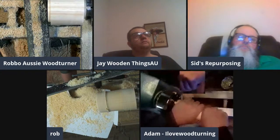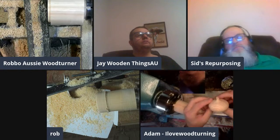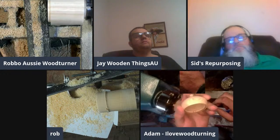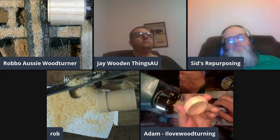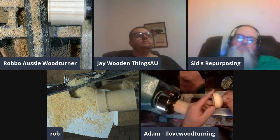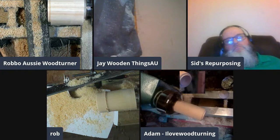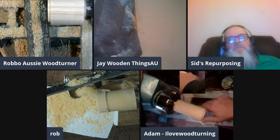When you've got that done, you can take the lids off the base if you like. Don't remove the bit of wood out of the chuck. Just take the lids off the chuck, off the bit of wood. Rightio. Now we get to the fun bit. Pulling out the inside. Just wait a second. Now, what we're going to do is make them like an egg inside. As if you can imagine the profile of an egg, it's got to be like that inside.